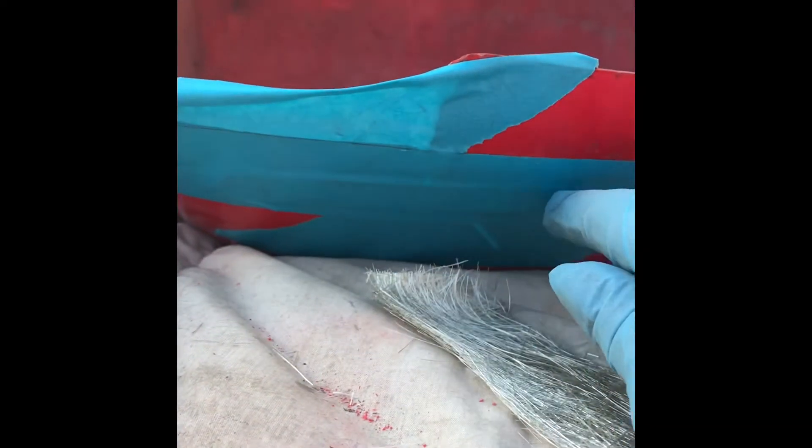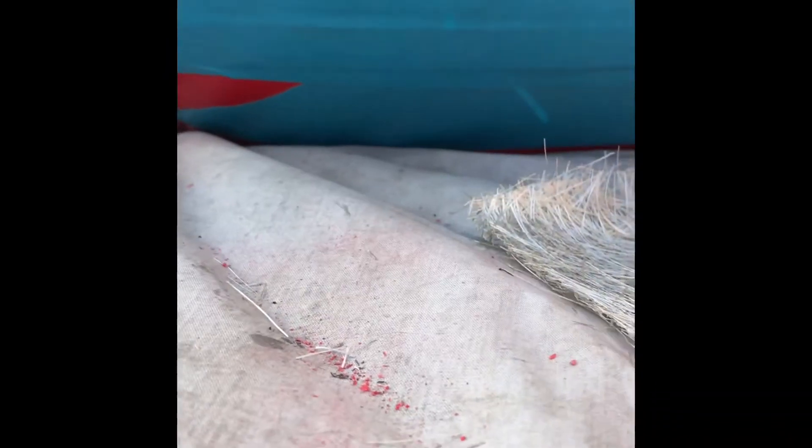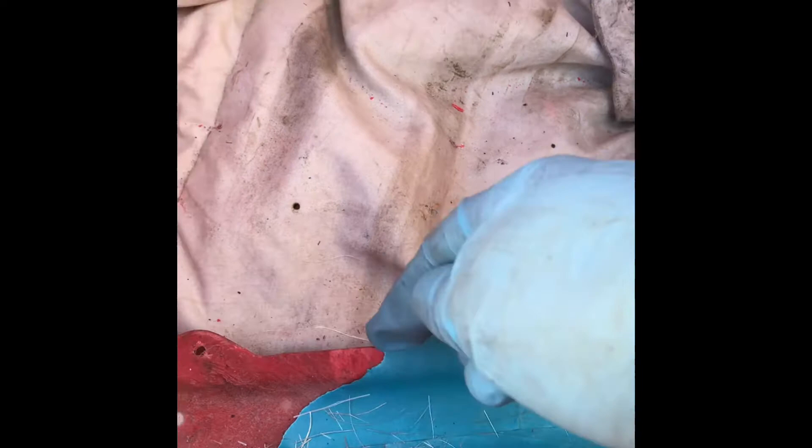I'll prepare the outside or the first piece here — put some tape over it, then tape across the actual crack with one of those small six-inch rulers just to make sure it stays nice and level. It seems to be holding its line pretty well. This one will take a bit more work to hold in line; I had to find a small clamp between these two edges but it wasn't going to hold well, so I might have to put a bit of a wedge top to bottom. I've also put some tape over here to stop the resin from running down and ruining the area I'm preparing.